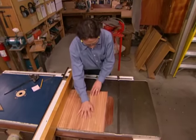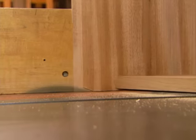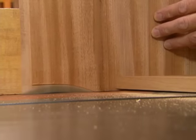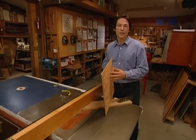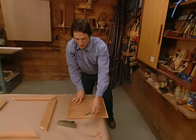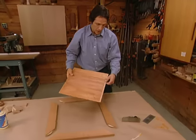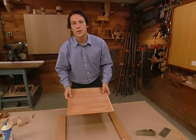Next, we cut our panel to size on the table saw. Then we add a rabbet around the bottom of the panel by using a square-tipped ripping blade. This blade will make sure the rabbet is a clean 90-degree surface. We've got the rabbet cut in the bottom of our bookmatch panel and now we're ready to fit it into our frame. We use a block plane and a scraper to chamfer the edge a little bit, making sure it goes easily into our frame.